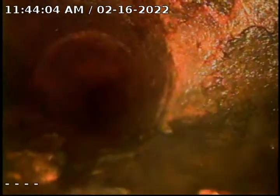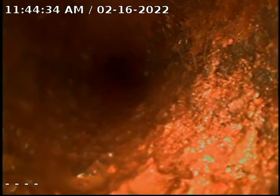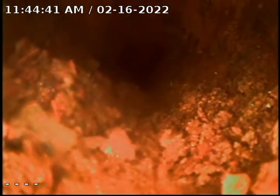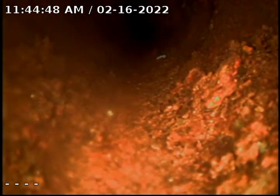This line is not too terrible — it's got a little bit of scale build up, but I'm still going to descale it. Where it ties in, there's a turn right there. As you come back, this line is not too bad with scale. It gets a little bit more rough coming back — starts getting a little rougher here, a little more scale build up. Once I finish here, we will run the jetter through here and clear this line out.